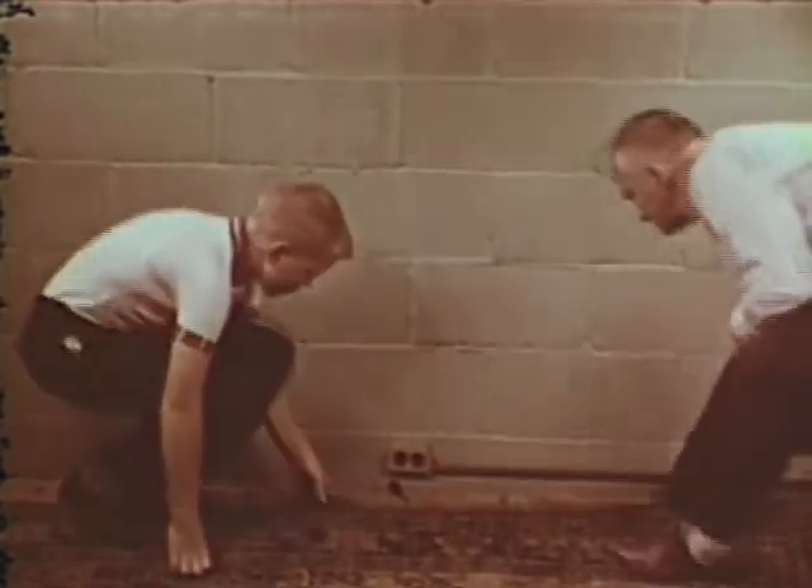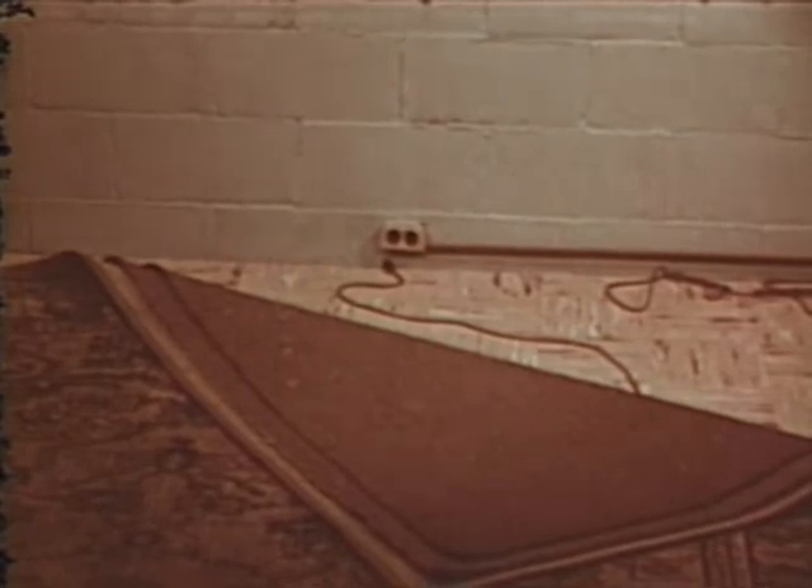Now look, there's something I hadn't noticed. I remember seeing a fire caused by a worn cord under a rug. The trouble all started when an extension cord had been placed under a rug. The cord was old and its insulation was getting brittle. Friction caused by objects passing over the wire broke off the insulation. When the insulation broke away, the bare wire came in contact with the rug. Now the wires become hot and the rug is starting to burn. We could have a serious fire here. Many people get hurt every day because of carelessness like this. Such electrical hazards must be eliminated.